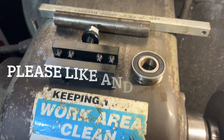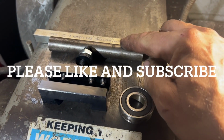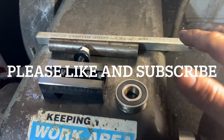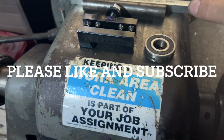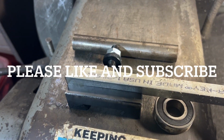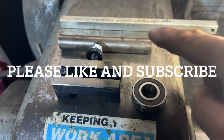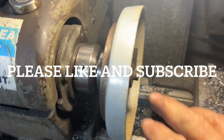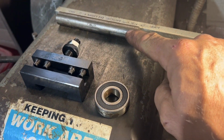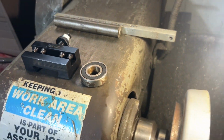Here's the parts I put together. Just a regular tool holder, a ball bearing I had laying around, some bar stock. This is actually a key stock, but I don't think I'll ever need a key stock this big. I'm going to take a piece of this, cut it off, fit it in here, and weld it to the back end of the round stock. I'm going to put the round stock in the lathe, turn down a little bit of the shoulder here to fit the bearing, and then drill and tap it for a bolt and a washer.